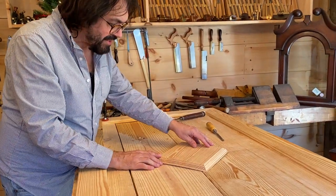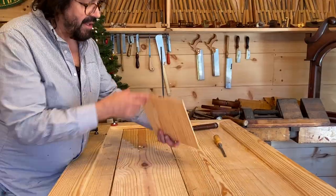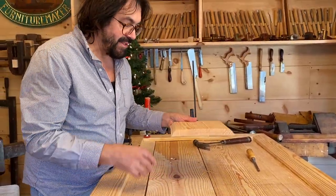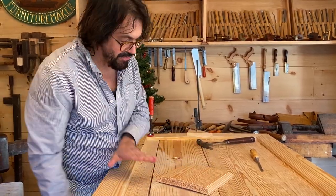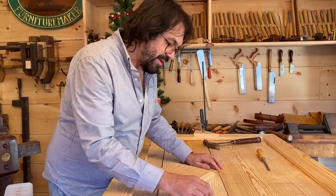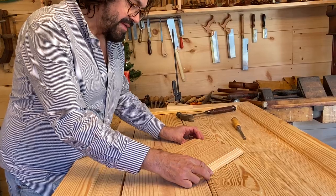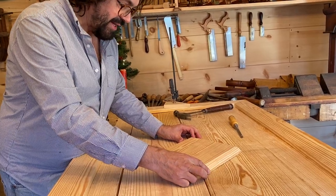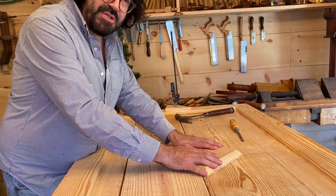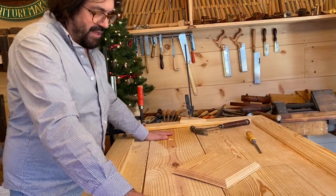Having a little problem here because these things don't come in totally dry. You can probably actually see the warp of the board. I don't have a clamp with a deep throat to pull it down, so I'm going to meet it halfway — I'm going to chisel out where the V tends to meet right there. This will sink down just a bit so it's relatively flush and stable as I start to build and radiate my diagonal moldings around it.